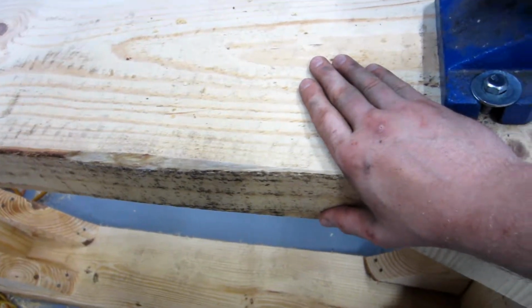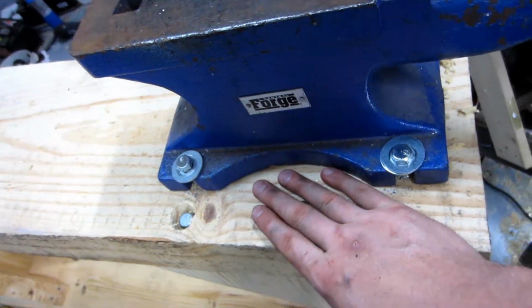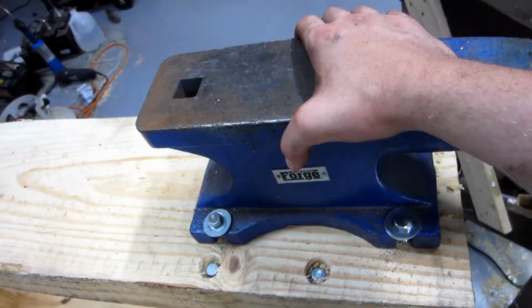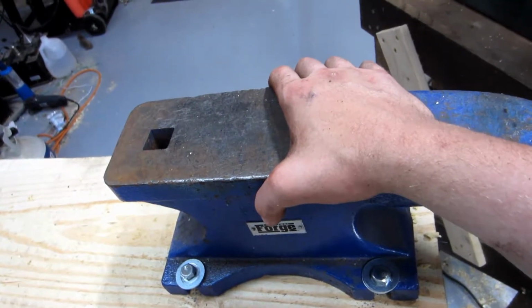You absolutely have to pre-drill or you'll get severe cracking. It may not happen in a year or even 2 years, but it will happen. Even with fasteners that don't claim to require pre-drilling, it's always a good idea to pre-drill.